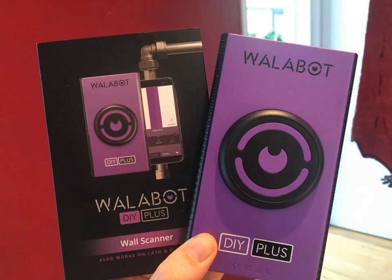These sensors can indicate the location, width, and lack of studs simultaneously. With more sensors, these stud finders do not require calibration and adapt better to inconsistencies in wall construction. A few stud finders use ultra-wideband radar scanners. They are based on the Micropower Impulse Radar Stud Detector invented by Thomas McEwan.